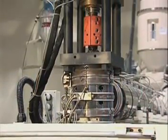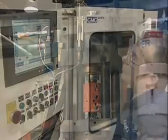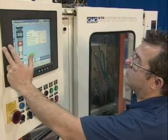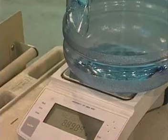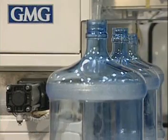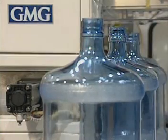Powered clamp elevation and die head positioning enable faster and easier mold changes. The C30 is controlled by a state-of-the-art PC microprocessor-based system with integral 100-point parison programming. With shot-to-shot repeatability and parison profiling precision, weights stay within a very tight range of a few grams only, while the machine's production rate of 140 bottles is among the fastest in the industry.